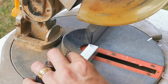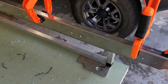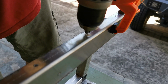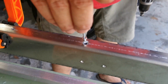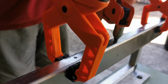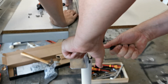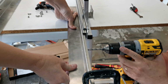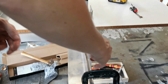The idea is to have the two base sliders being able to open independently, to be able to access the items underneath the sliders, but also to, on the left-hand side, create an area for the fridge to attach to and slide out without the need of having to add an additional fridge slider, which can be quite a heavy and expensive item. And then on the right-hand side, either to have that as a slider on its own, or to attach a drawer to it and then have the addition of the slider and a drawer, which can then have items strapped or lashed down onto that particular drawer.